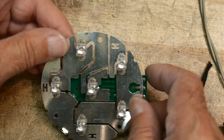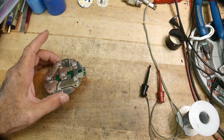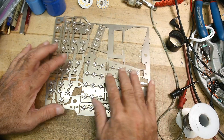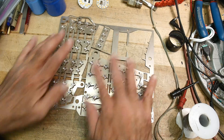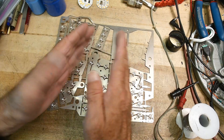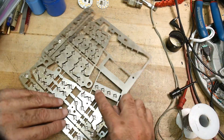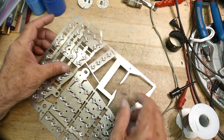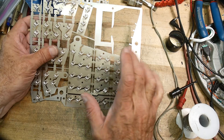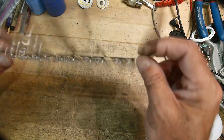This one has a little board on it. He said these were used for fancy tail light sections. He gave me what I believe is a test piece where they were trying out this method with different patterns. These were made flat and then bent up into the final shape — you could fold them into a curve or other configurations. Obviously these are tests because if you look at this set of LEDs, they're all crimped onto a single sheet of steel and it's all shorted out so they wouldn't have worked. But these others show some separation — two in parallel and then others in series. They were just trying different things out.